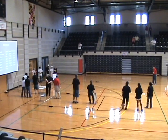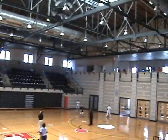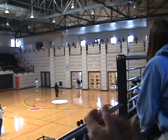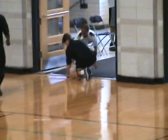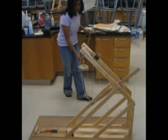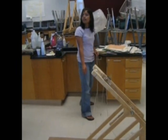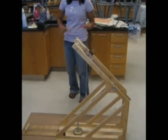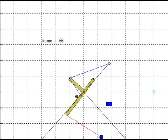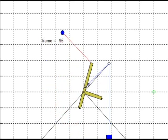Mesa Nationals, June 2008. Tucson Himes seals their victory with a 35-meter distance shot flying out the front door of the University of Maryland gym. Their nearest competitors are almost a factor of two behind them. They have developed a new kind of trebuchet called Merlin — for multi-radius linear nodes — a variant of a wheel trebuchet with discrete attachments called sprockets, tuned to get every last bit of energy from a falling counterweight. These trebuchets regularly record efficiencies above 80% and win back-to-back national championships in 2008 and 2009.